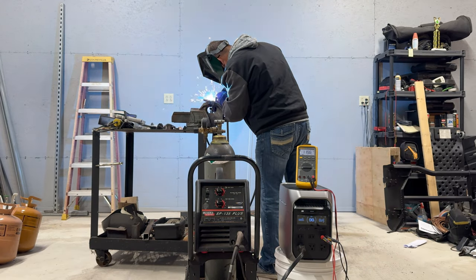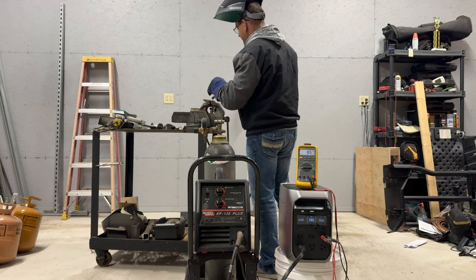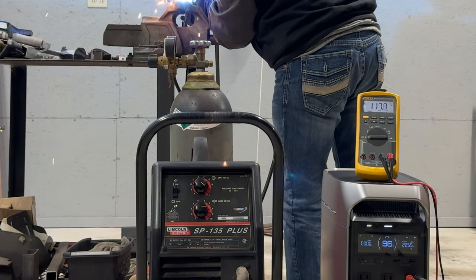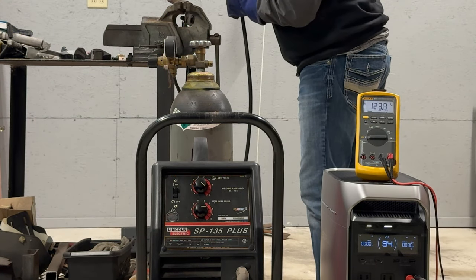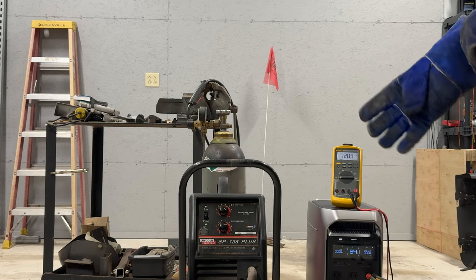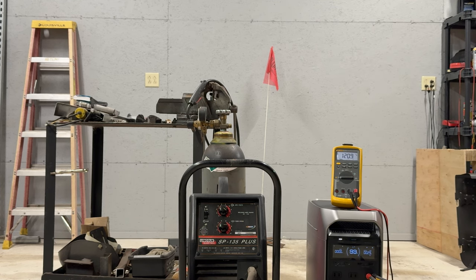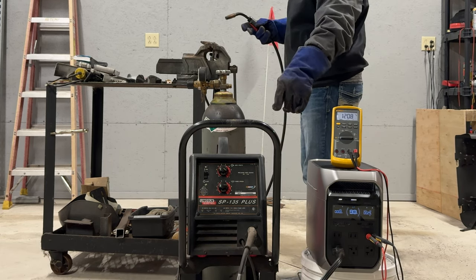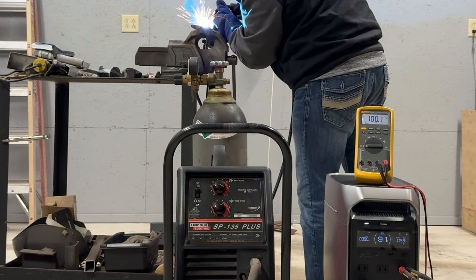Let's go ahead and crank it almost all the way up to J. I actually grounded the tip, so that was my fault. Seems to be doing just fine this time. Very good — it did it no problem at all. I went ahead and turned on X-Boost. Playing back the video, I noticed we were running 2,200 watts for quite a while, and this is only rated for 1,800. The voltage will drop a little lower now, and the wattage should stay under 1,800. Actually, it's running a lot better now.